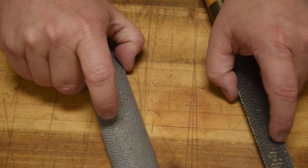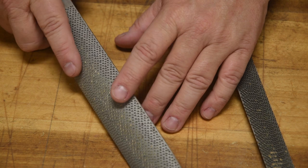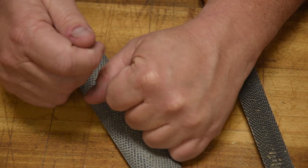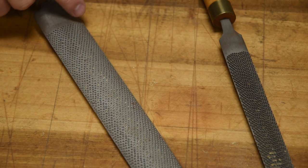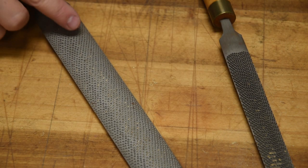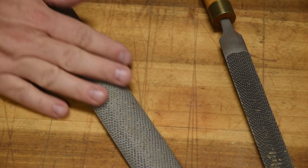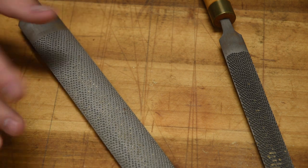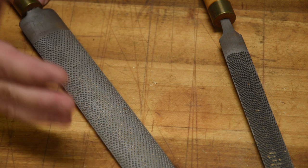I've seen the guys that make these. They basically take a piece of steel that's been softened, meaning not hardened, so that they can make these little indentations, and they sit there and they just go tap, tap, tap, making a row at a time. And because their hand movement is very inconsistent, you get that random pattern on both sides. At which point, they reheat them up to red hot, quench them in oil, and that's it.